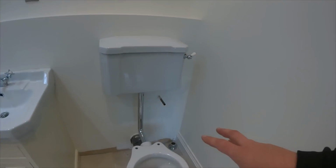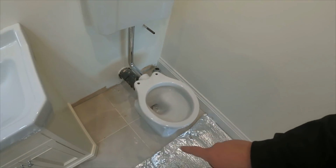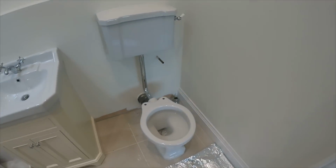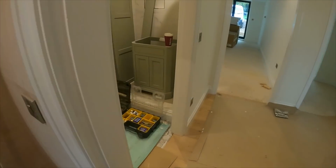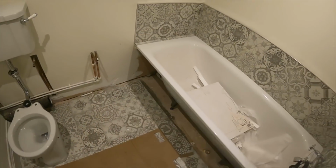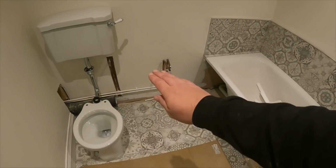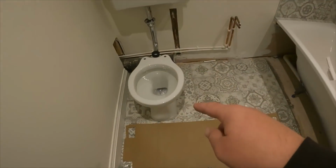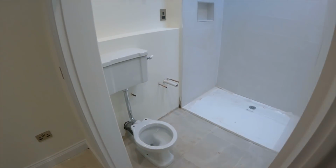So we've got these cisterns in now. The pans aren't connected in, as I've said, because I want to make sure where the underfloor heating is. So that one's done. I've got that shroud to go on at some point. The main bathroom one's done. So that means we can get the panel on tomorrow, possibly, if the chippy's doing it, and they get that unit in there, and then they can box down the back and fill that. So that one's in, but again, pan's not fixed down because I want to make sure exactly where the underfloor heating is. Again, this one's in position.